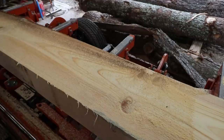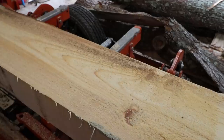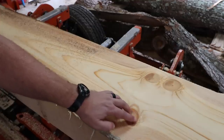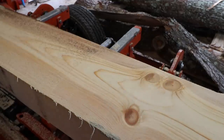All right, friends, I'll stop sawing here for just a second. I want to take a look at these boards and make sure we're sawing true. I always want to do that when you're sawing. I see some guys — they'll saw three or four logs with an off-bearer and won't check one board as they come off. I'm a firm believer in quality control. Every few boards you need to check them by hand and make sure you're sawing nice and flat. Let's knock some dust off this one and see how it looks. There's a little bump right there around that knot, but sometimes you cannot get around that. These knots are hard — there's no way sometimes not to get a little tear-out on the side of a knot. But that's not too bad. I can live with that. That will come out whenever we run this through a planer.